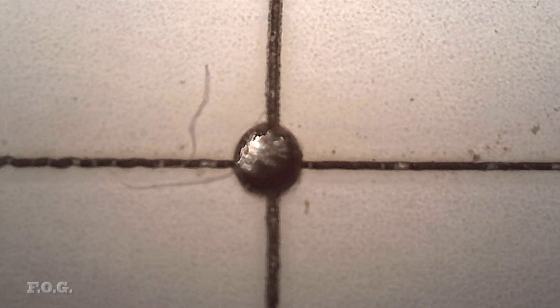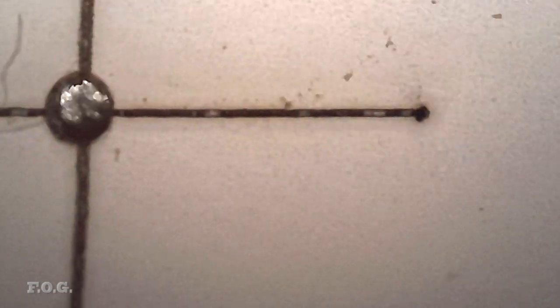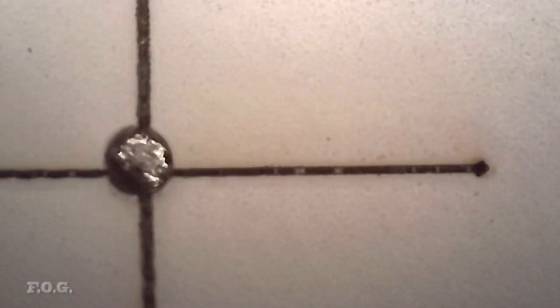I fiddled around with this quite a lot until I got it right. I think I didn't really have a good mental process, because there's a lot of different variation. There's the play in the CNC that moves the holes around. There's the fact that the mill and its run out might drop the holes a little bit differently, so it's really hard to figure out if the misalignment is because of those factors or because of the alignment of the sensor itself. I ended up fiddling around with that for, I think this is the last one that I had, the 12th test.